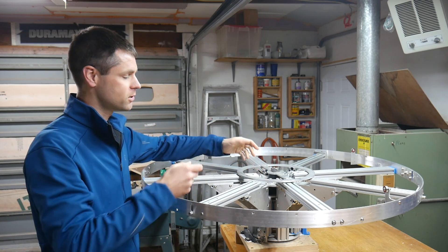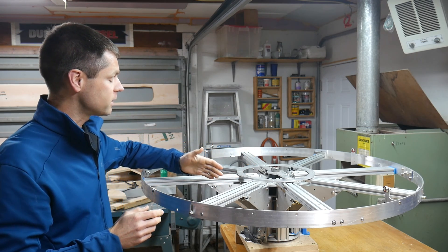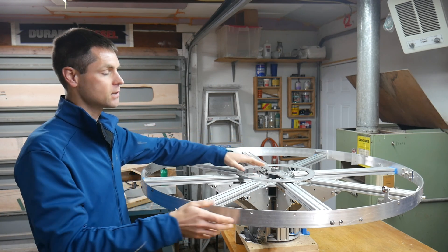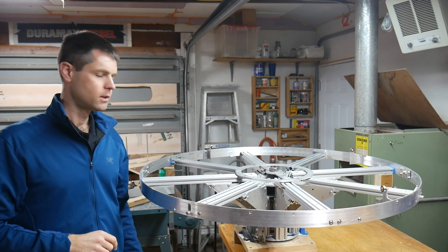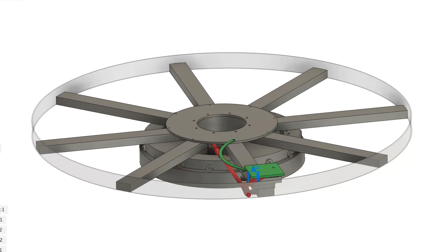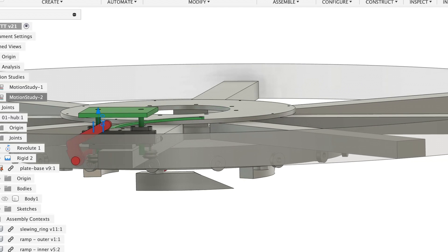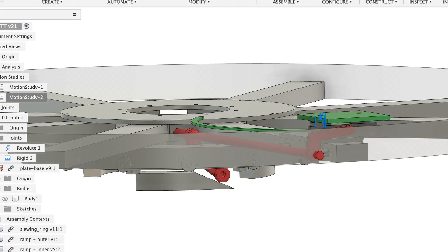This has a D-shaft in the center, but there's still wiggle, and this is a problem when you're trying to control everything very nicely. You basically end up relying on torquing this down a lot, and that creates a lot of preload on the taper bearings, which you can feel. You could possibly go to a jam nut setup, but you just start running out of room. So the next step is for me to take what I've learned, spend some time in CAD, work out the proportions and dimensions of the next prototype, and figure out what we want to build. Basically it's going to have fixed tracks, a DIY slewing ring, and torque tubes that come out and engage when the cart is in the outer position. Thank you for watching.